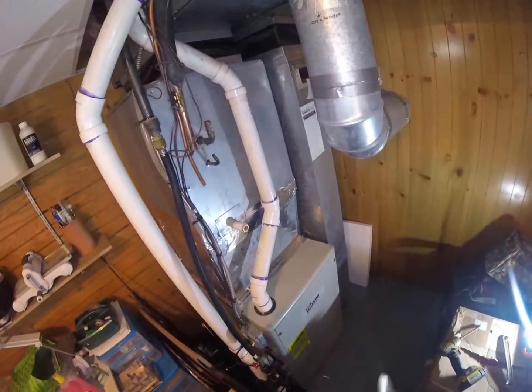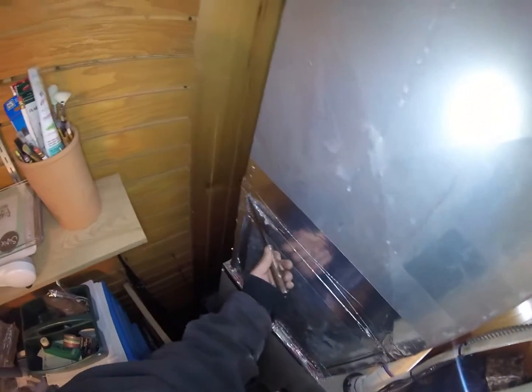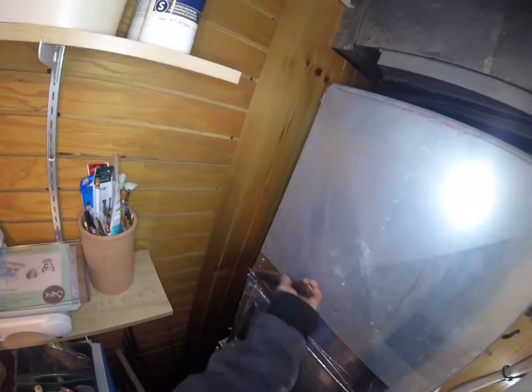Plenty of tape. I don't really like using tape if I don't have to. I typically use silicone sealant, some gray silicone caulk, just to close up any holes that aren't tight. That's just my preference. Technically, mastic sealant is the best to totally get your duct system sealed airtight. Doesn't look very pretty. It's kind of messy looking, but it does the job. It does seal your duct.